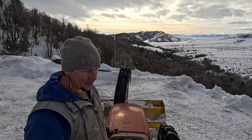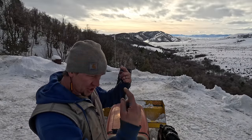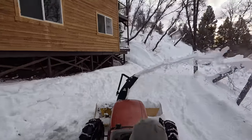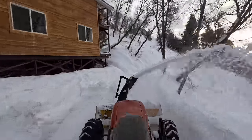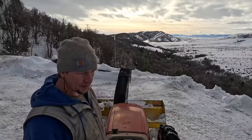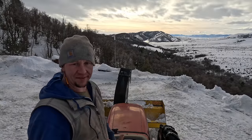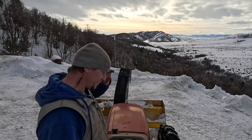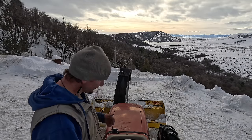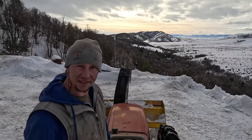I think what's happening though is that there's so much inertia from that fan going like crazy trying to eject everything, that when it binds up enough on that auger, there's just not enough give between the two, and the inertia of that fan is just hard enough to pop that through bolt. So anyway, we're just trying to get through it at this point.